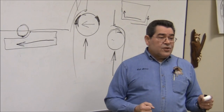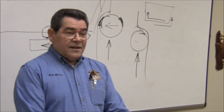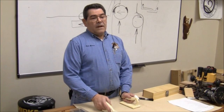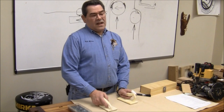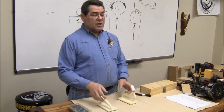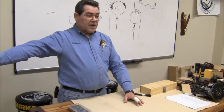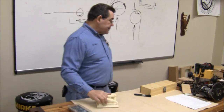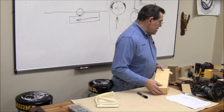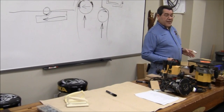I would not recommend doing a climb cut on a router table because you don't have anything to limit its travel. You can use a pin and let the wood lay against the pin — that gives you more control over the workpiece and it's a little bit safer to do a climb cut. Normally in my shop, I keep push blocks on the jointer to my right so I have them easily accessible. Some of you are aware of how I got this bandage — it was on the router table. As Forrest says, stupid is as stupid does.